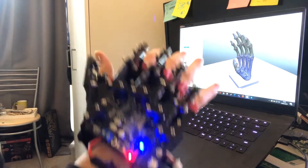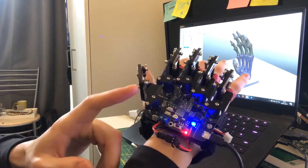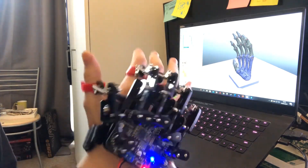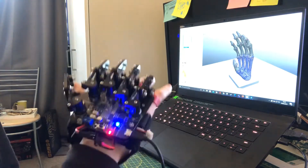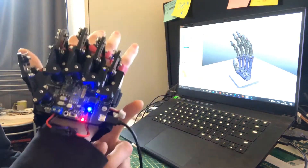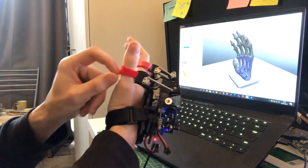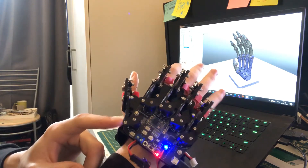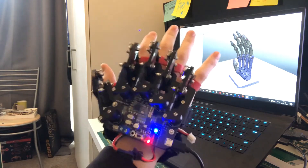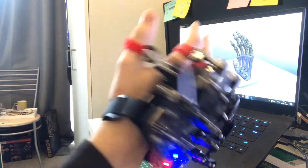This is the Banggood Data Glove. It uses an Arduino Uno housed with five potentiometers, a gyroscope, an accelerometer, and a Bluetooth module for use with other products from this website. It can operate off a 7.4V LiPo battery or be connected via micro USB. It uses levers coupled with rings worn above the knuckles to rotate the potentiometers, so the movement of the fingers gets translated into different resistance values read through the ADC pins. The straps attach at the fingers as well as across the palm and below the wrist.